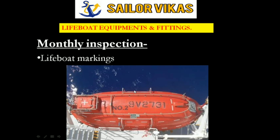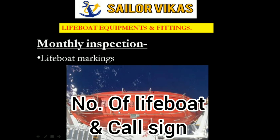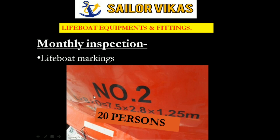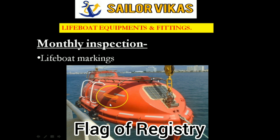As you can see here, the number of lifeboat and the call sign should be visible from the top in block letters. Then on the side you will see the lifeboat dimension, then the number of lifeboat, whether it is number 1 or number 2. Similarly, the number of persons which it is designated to carry. Then the name of the ship, as you can see here, and the flag of registry. These markings are very important in lifeboat. Make sure that they are never faded.